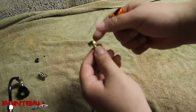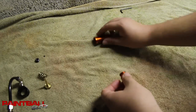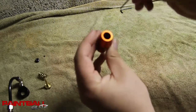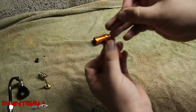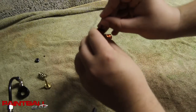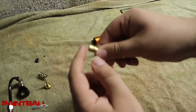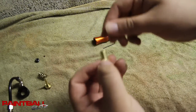There's an O-ring on the piston, so make sure you take this apart and oil it with some lube. Now here in the end cap, we have the seat sealer in here, and that's right down in there, so on the top we're just going to take an Allen key and poke it out, and it'll just fall right out. There's an O-ring on the bottom of this too, so make sure you keep that lubed up.